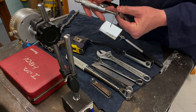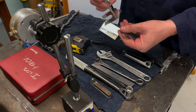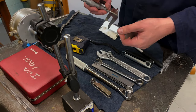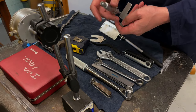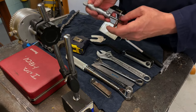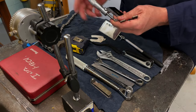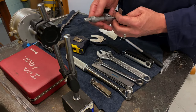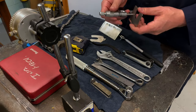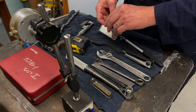This one says it's four thou and on my micrometer I've got about four and a half. The point is that if you stack multiple 4-thou shims on top of each other, you can compound the error. So you always want to mic all your shims before placing them. This one says it's 100 thou, but when I measure it, it's actually reading 96. The larger the shim, the larger the potential error. You want to make sure the error between feet is not more than two thou, otherwise you're inducing soft foot into the electric motor.